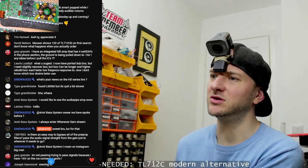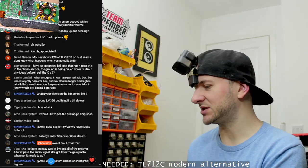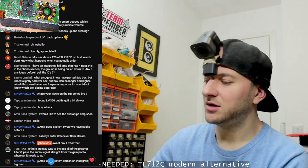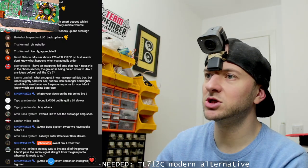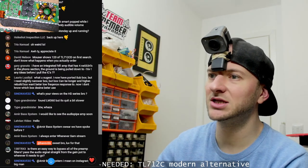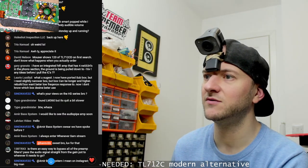Just go for a ported, dude. It's nice and easy. You've got a bit of room for error in there as well, and it can still sound fine. So yeah, just redesign it with the dimensions that you need. I don't know what you were tuned to before, but 28 is always a nice place to be, I find. I quite like a 28 hertz tuning. Plays low enough for most stuff, and still has some good punch on the higher stuff if you design it right.